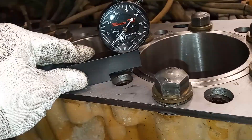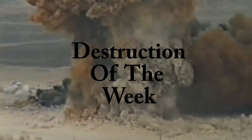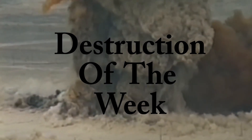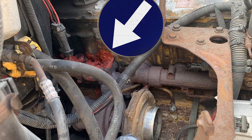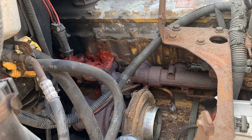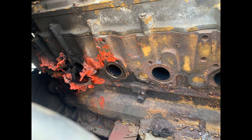And how about a little destruction of the week? This week's is a viewer-submitted one — more like maybe not the best repair of the week. A 3126 — Jake sent me these pictures. You can see the exhaust manifold on the left. They had an exhaust leak and the bolts were falling out, but instead of fixing it properly they decided to get as much silicone around the leak as possible. Obviously with undesirable results — it did not fix the problem. Still had to get it removed, get new gaskets, and fix it correctly. Also the clamp was missing some spacers, so they decided to silicone that too — and for some reason there's a coat hanger in there.